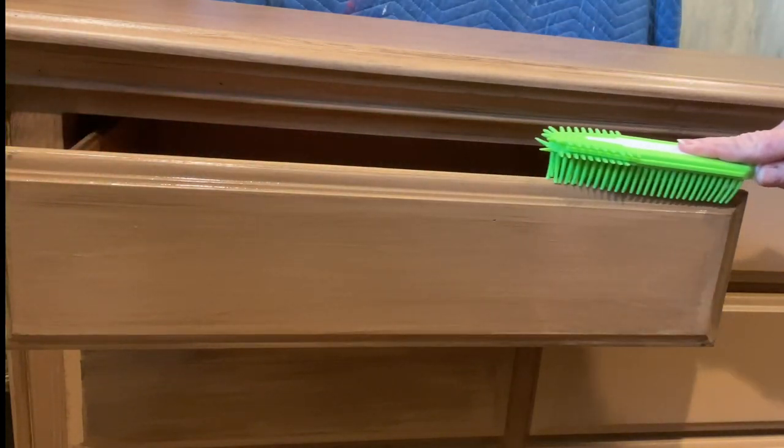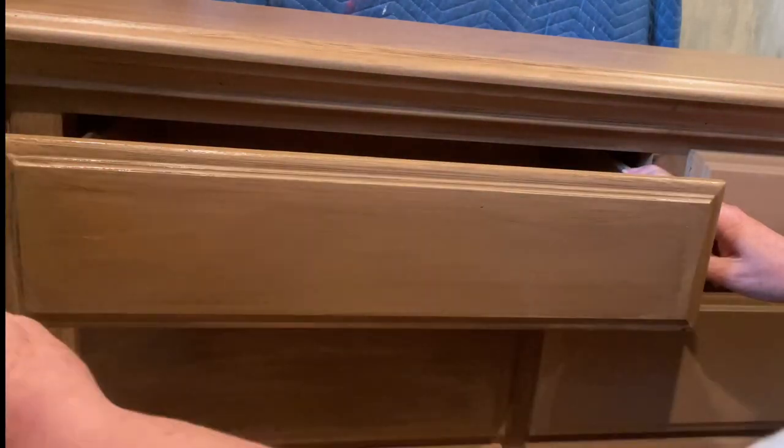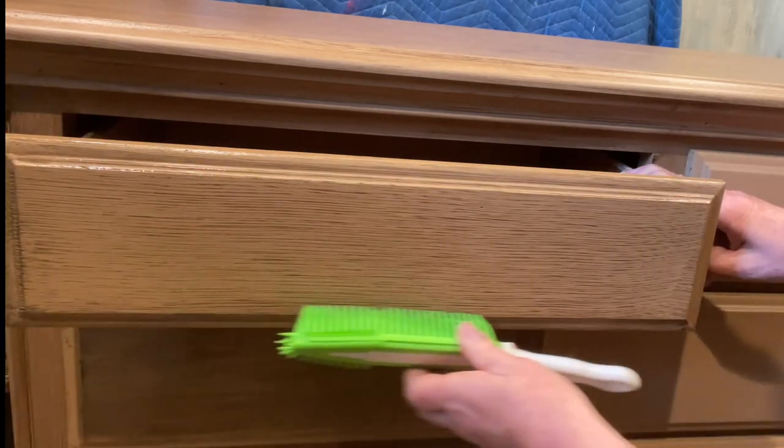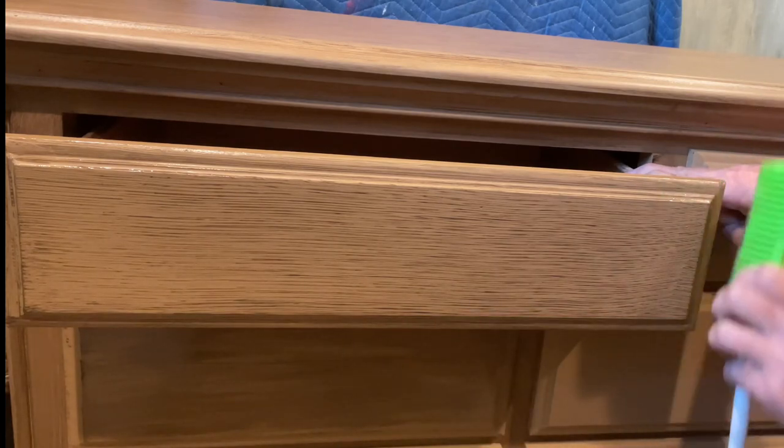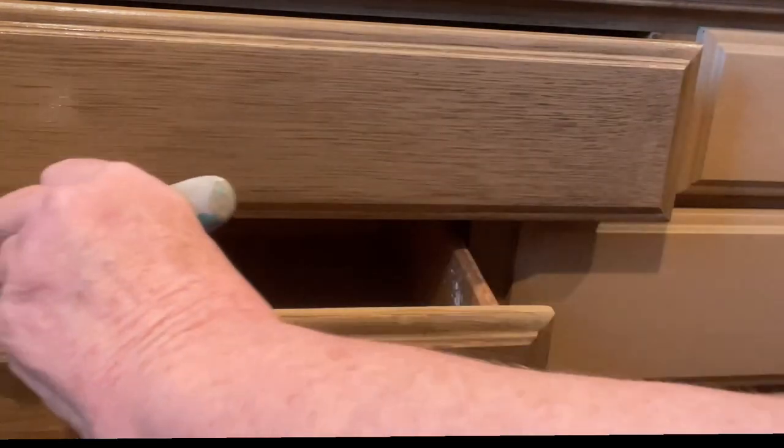I've got the drawer smooth, and you also don't want to use too much glazing base at one time. Here comes that magic tool — that dog hair remover brush. You want to keep a straight, level hand so that you get those striation marks really level. Just keep going back and forth — that's really the key. If you don't get it the way you want, just go back over it with the synthetic bristle brush and there come the lines, back and forth through the edges. It gets a little heavy on the edges, which is another reason you really want a flat drawer front.